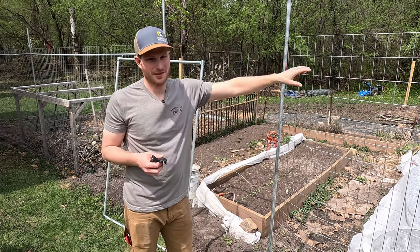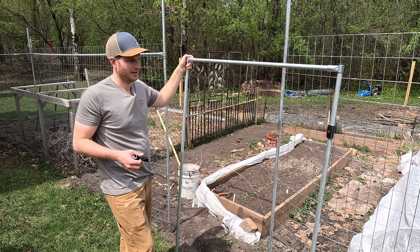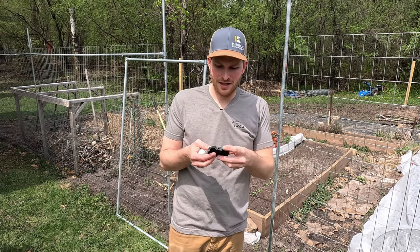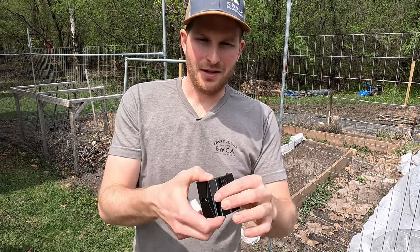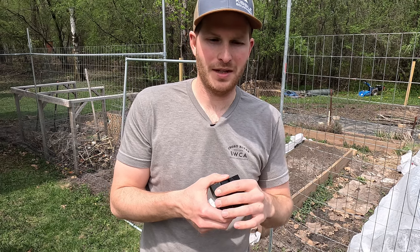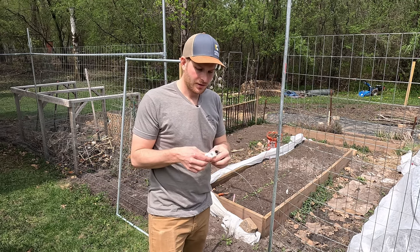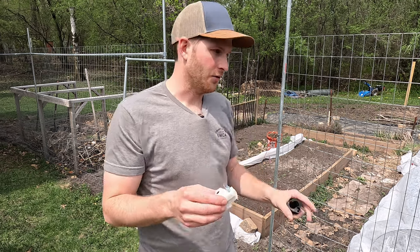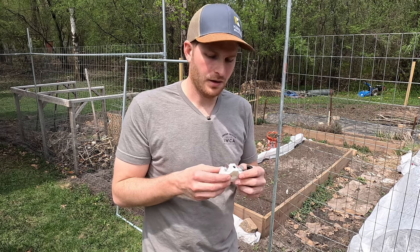Now that I've got the fence mostly up on this side, I'm going to be adding the door. The door is just a simple square made out of Maker Pipe connectors and conduit — just 4 T connectors and a few straight pieces. For the hinges, I'm going to be using some 3D printed hinges that I designed myself specifically for use with these conduit doors. Two halves go together and use a bolt as the hinge point. I've got a separate video on these that I'll link above and in the description. I'm going to mark out the holes on this tube, drill them using my 3D printed drill fixture, which has a hardened drill bushing and goes around the tube so you can easily drill a straight hole all the way through.